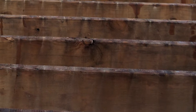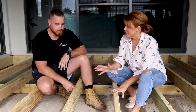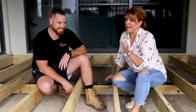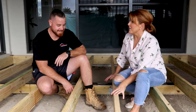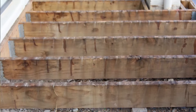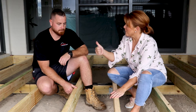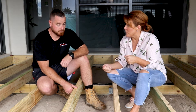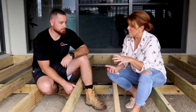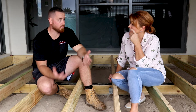Even if your deck looks great on the surface, your substructure could be compromised. In this circumstance, we have been able to keep quite a bit of the existing subframe, but there was a section that was absolutely trashed — it had moisture and probably had about three years left in it, with very few signs on top. So number one would be to get a carpenter in, lift up some existing boards, and check it's not rotten, there are no termites, it's not damping up, and that you have enough structural support to hold the weight.